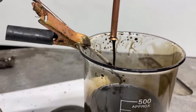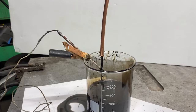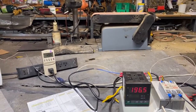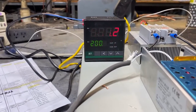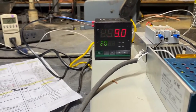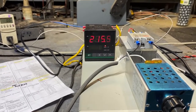Those bubbles cause interruption in fuel delivery, which is seen in a flame out in some cases. So that's why it's often detrimental to optimum operation. So I don't know how much I like what we're seeing here. A little bit of a tune there. Now we should see this thing just kick right off. Any second now. Oh man, this is too much. There it goes. So it allowed itself to go up 12 degrees. I got a slight adjustment to do there.